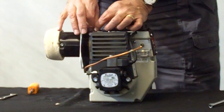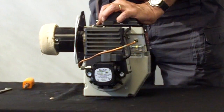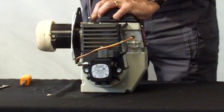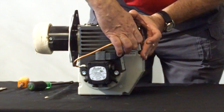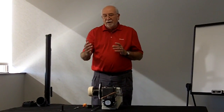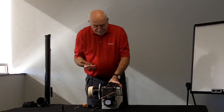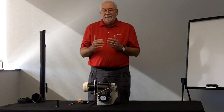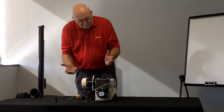Close your igniter and put your nozzle line back on with your spline nut in place. Now you can fire off the burner and make your adjustments accordingly. If you find your CO2 is too low, move the head forward to give it less air. If you find your CO2 is too high, bring the head backwards towards 5 for more air. And that's where your adjustment is.